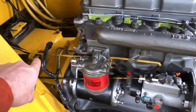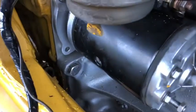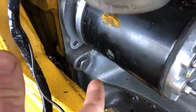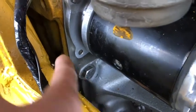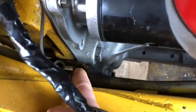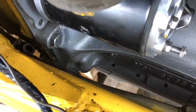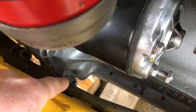This is a very critical point because you don't want to damage the pump seal while the torque converter slides in. In the transmission, on these top bolts - which are threaded into the transmission - I bought two 5/8 coarse thread bolts about eight inches long, cut the heads off, ground them down as nice dowels, and threaded them in. Down a bit further there's a bolt that goes straight through with the head down and the nut up here. A half-inch piece of copper pipe is the perfect size - it's got a little play so you can wiggle things but won't let anything get too far out of alignment. I slid a half-inch bolt inside the copper pipe and put a bit of Vaseline on those so they would slide.